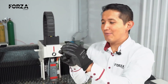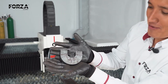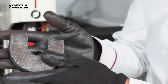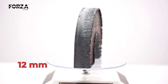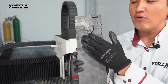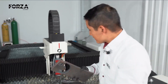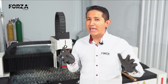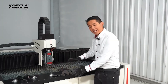This here I really wasn't expecting at all — we're talking about 15 millimeters on a 1500-watt machine. Look at the shape — it's perfect. Even the edges and corners don't have too much heat concentration, so this could easily be a functional part if we do some post-processing to remove the burr. What amazes me is that the cut offset is actually very small, meaning the laser is quite thin and doesn't leave a cut that's too wide. I hadn't planned this, so we don't have any more thicknesses left to cut. I could bet that at 20 millimeters, we won't be able to cut through it anymore, because right now we're working at pretty slow speeds.